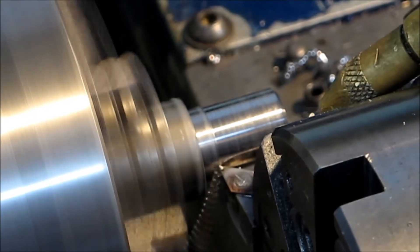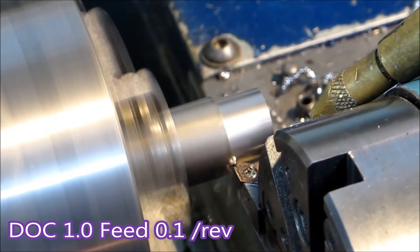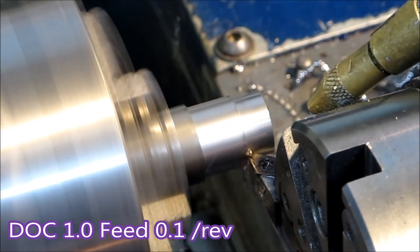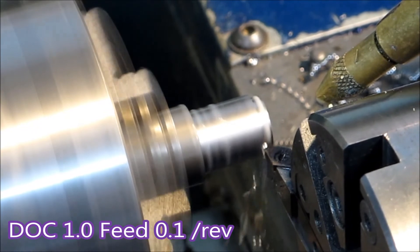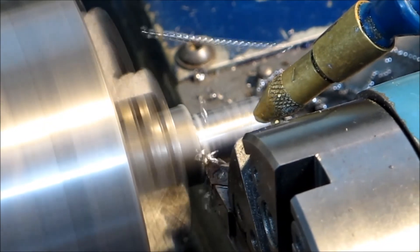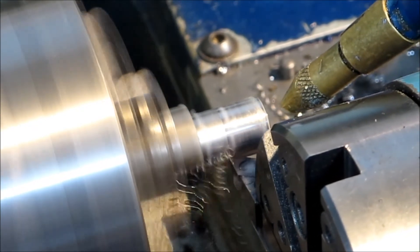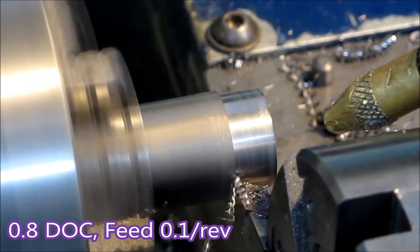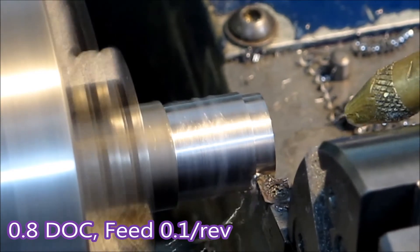Again, that'll be the final pass of the stock removal cycle — you can see the finish is not bad. Now this is where you shouldn't go: this is one millimeter at 0.1 millimeter per rev, and you can see the chips are breaking quite nicely, but this is not recommended for this insert. The insert puts up with it okay — you can see those chips are actually breaking. I'm not recommending you do that because it's not on the chart for the insert, but these parts — there were not a lot to do, the size did need to be accurate but tool wear was negligible.